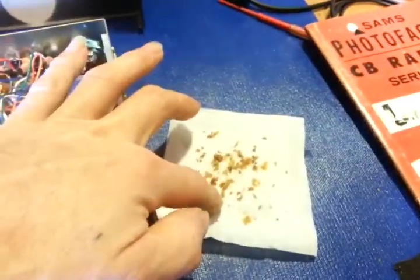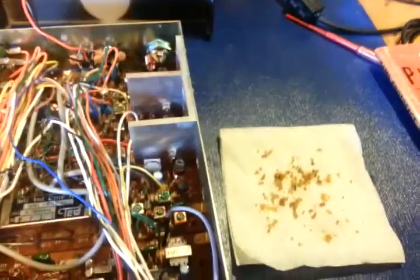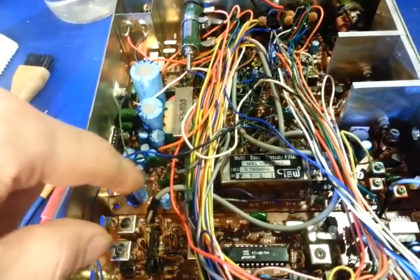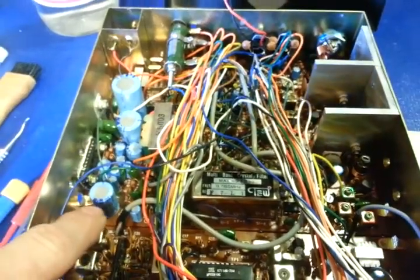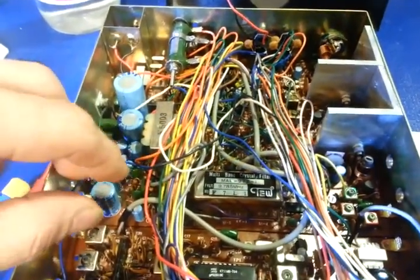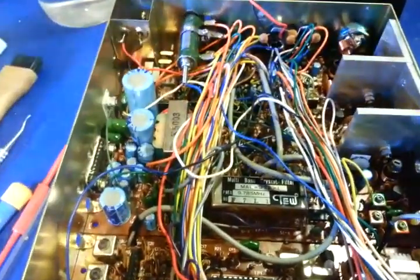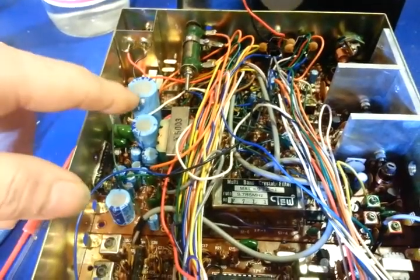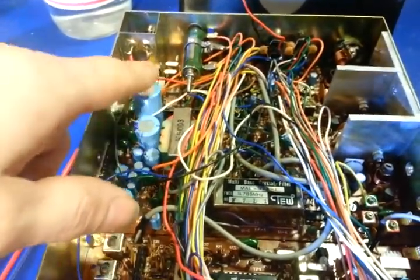If you look in there and you see that stuff and it hasn't done any damage yet, you've been blessed by the CB radio gods — but they're trying to tell you something: get that stuff out before it eats your radio from the inside out. It's the same thing with electrolytic caps — these things not only leak internally, they leak externally. If that electrolyte oil leaks out, it's corrosive and will eat circuit tracks. Even on single-sided boards like this radio uses, it can still leak through the terminal hole, dissolve the solder, leach up around the sides of circuit traces, and eat your copper traces away. That's one of the reasons you want to change all your electrolytic caps — especially the big ones, they'll leak out a lot of oil. That's the kind of maintenance work you want to do: change stuff like that before it does damage.